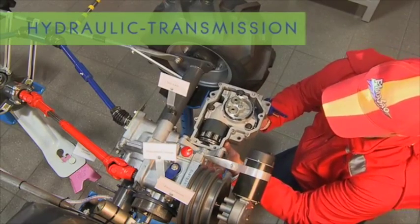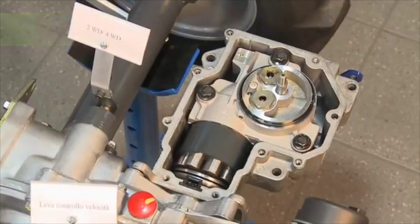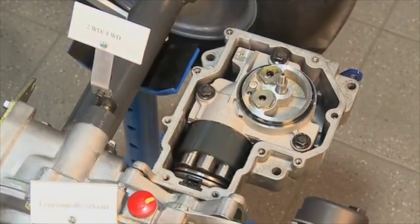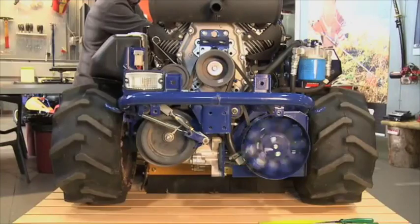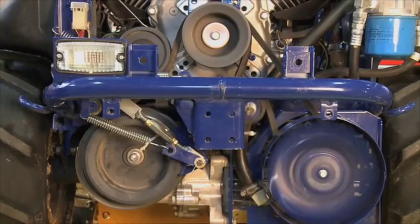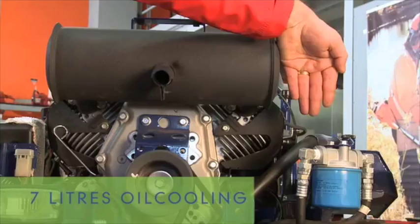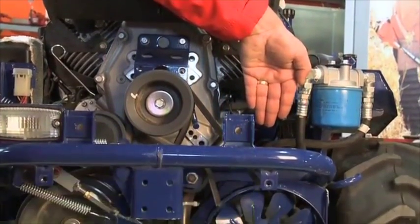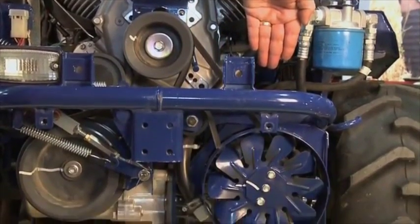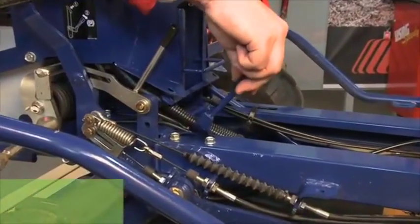At the heart of the four-wheel drive train is the Hydrogear hydrostatic transmission, which has a charge pump. The hydrostatic system includes a serviceable oil cooler. The reservoir holds over seven litres of hydraulic oil in constant circulation, providing the ultimate cooling package in our hot Australian conditions. This is a commercial grade transmission built for heavy cutting applications in extreme conditions.